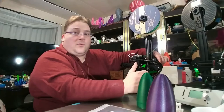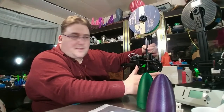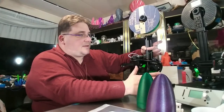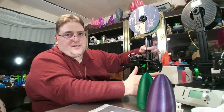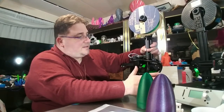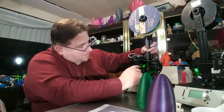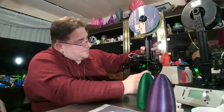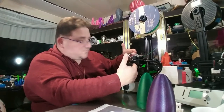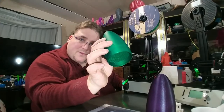You don't need the rod to hold it in place. The rod should not be guidance. The rod should only be movement. This is your guidance, not this. But if you make this rigid, this becomes guidance. And if this isn't perfectly straight, you see here? See how I'm moving it a little bit? And how it moves the rest a little bit? Well, if this binds up, it's going to push on the rest of this. And maybe that pushing as the rod turns is just enough to give you that little bit of noise.